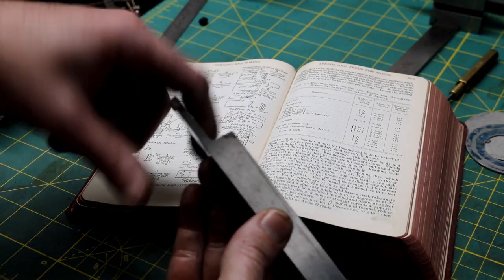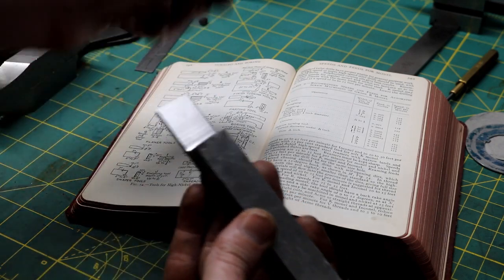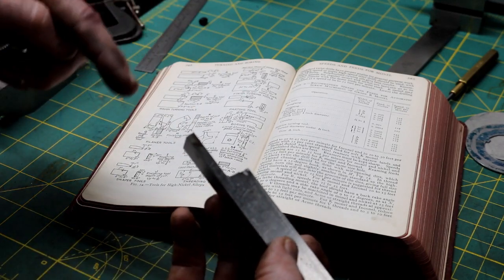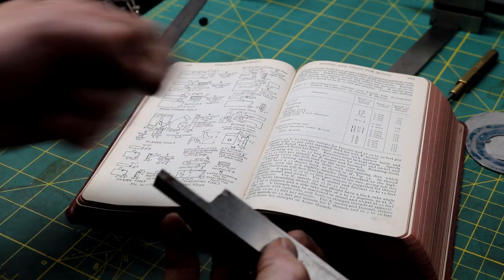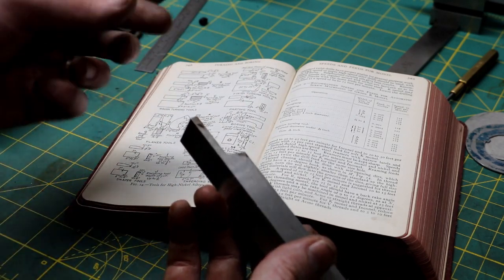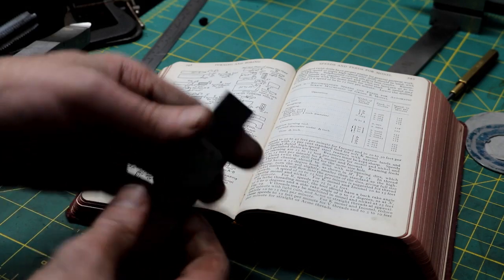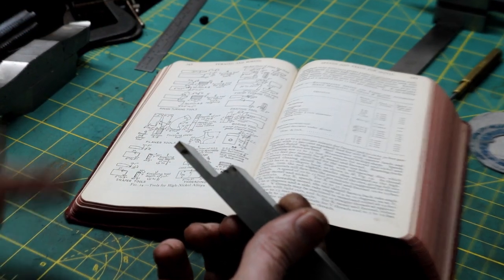Now, I knocked this edge out of it with the pedestal grinder, and then I just refined the shape in the cutter grinder. So that took a while. I tried an abrasive saw to just cut my blank out. That didn't work either. It just created a bunch of heat. So, old school, standing at the bench grinder for at least 30 minutes, and this is what I've got. I've got a couple of clips of me squaring this up.